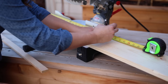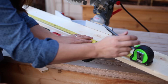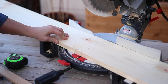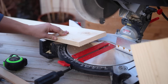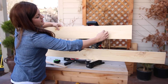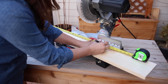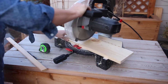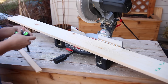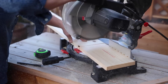The first thing I like to do is cut all of my lumber to the appropriate sizes, which makes assembling a lot quicker. I'll take a one-by-six-by-eight-foot board and cut a five-foot piece first, then from the three-foot piece that's left I'll cut a 22-and-three-quarter-inch piece and an 11-and-three-eighth-inch piece. I'll do that with all four of the one-by-six-by-eight-foot boards. The five-foot pieces will be used for the back assembly and the shorter pieces for the sides.